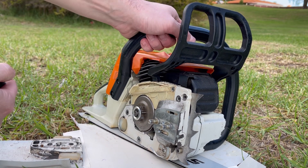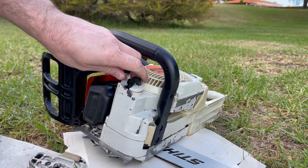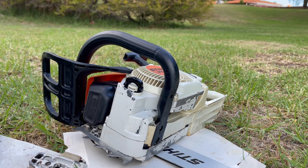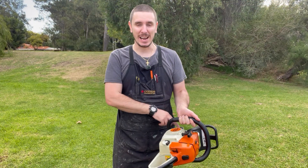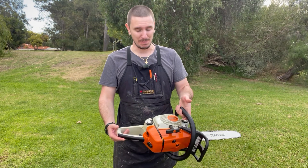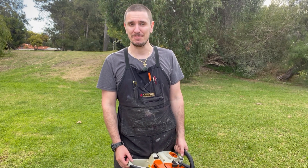To avoid that, empty your oil tank whenever you're not using your saw, or alternatively turn it on its side and crack the cap — just remember when you come back not to tilt it over or you'll lose all your oil. That will stop pressure building up and you won't have any leaks at all. So there we have it — cracking that tank cap or draining the oil, along with running through those other steps, is more than likely going to solve your problem. Hope it helps and saves you some money — until next time!